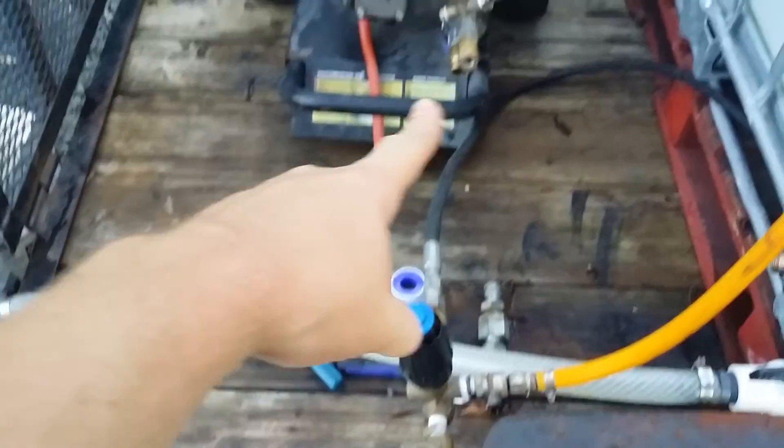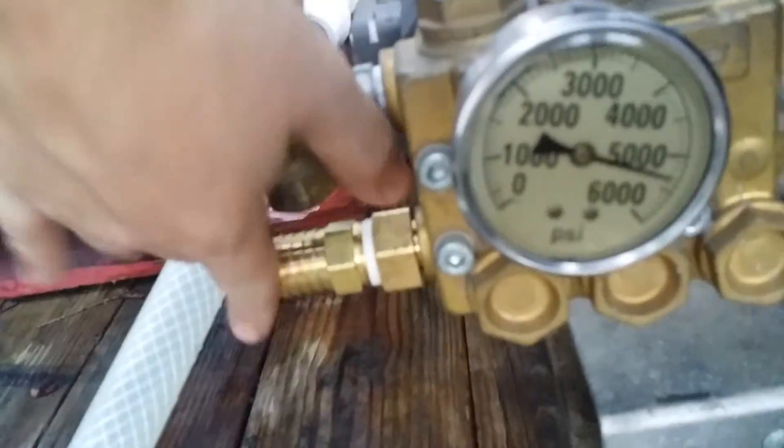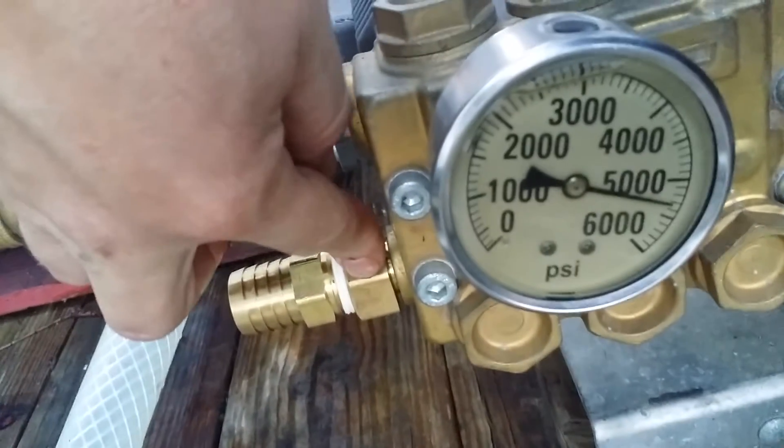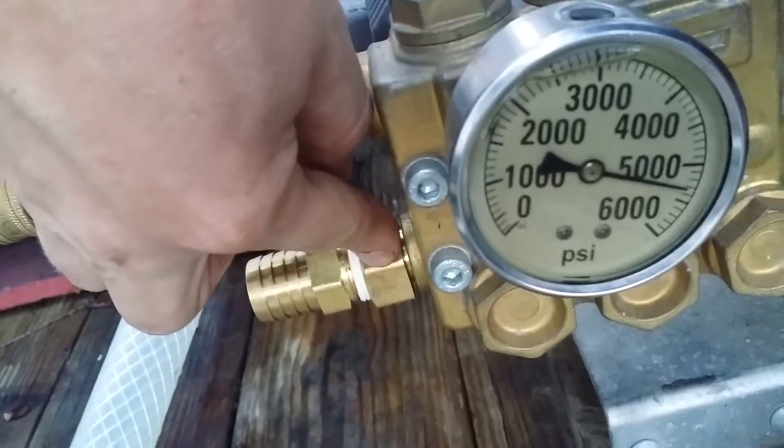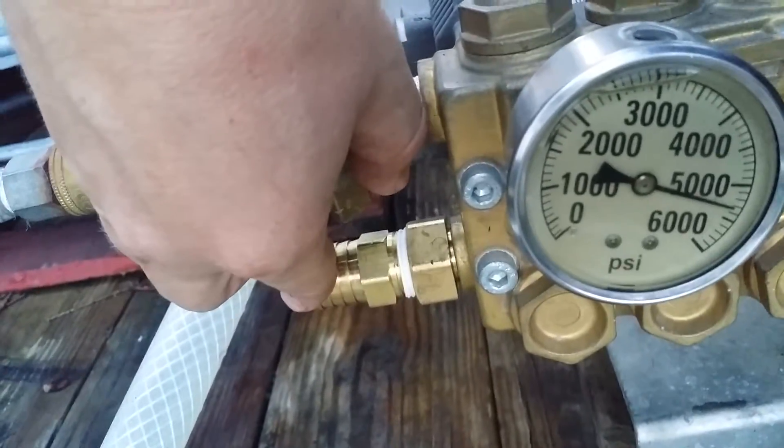Run these two around. So this one actually loops underneath the pump on the plate, and then it's going to come over and just a couple onto there. And then this one, I actually put a larger section of hose so it's going to do a nice little loop and come around here. I got the 1-inch barb to 1-inch threaded, and then this is a 1-inch female to half-inch. Got this all from Russ, as well as the Y strainers — that's outside equipment.